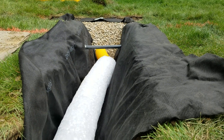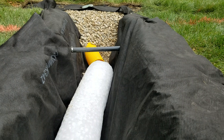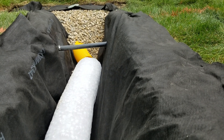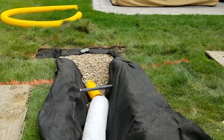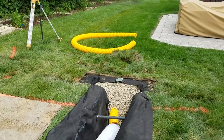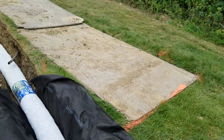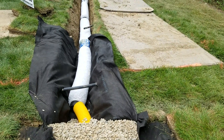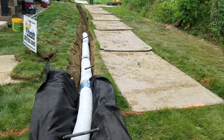So if we do it like they say — line the trench and put the Easy Drain in — my stone just pours to the shape of the trench I dig, but this doesn't. When we backfill, we're supposed to use something permeable, and they suggest topsoil. Well, here in Michigan it is so rare to get sand-based topsoil. Everything is clay-based, so I'm left to just use common sense.